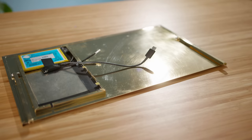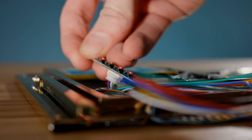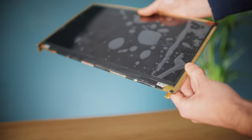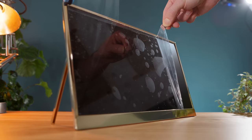With that, the control board can be glued in place. However, as the chamber is so thin, the keypad is just too tall to fit inside — but removing the connector and soldering the wires directly is an easy fix. The keypad is then glued to a custom lid, which can be screwed in place. To cover the still-exposed bottom of the LCD panel, a strip of brass is soldered to the last U-channel, making a great cover for that area. With it now complete, it looks absolutely fantastic and is a real testament to the beauty of brass.